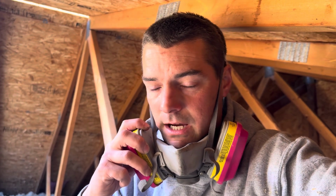So bathroom ceiling fans don't have a lot of pressure. They've got volume. They're going to push that volume through. The farther they have to push, the less effective they're going to be. And you couple that with the condensation, it's not going to be good. Then try to dig in here. I mean, literally, they just blew over the line and terminated somewhere. I haven't even found it.